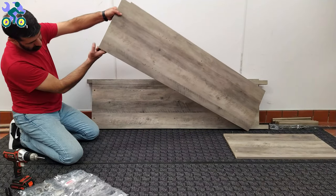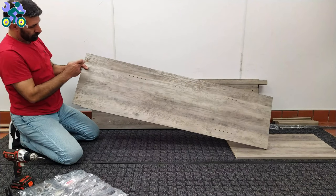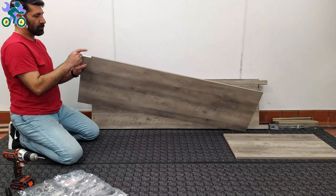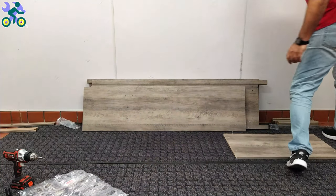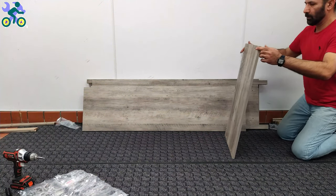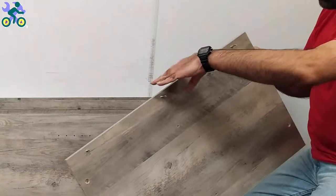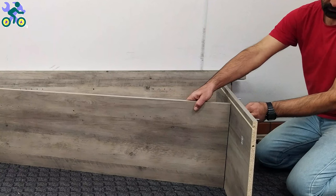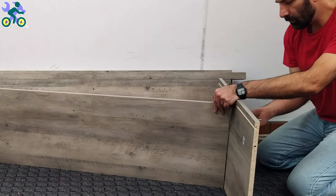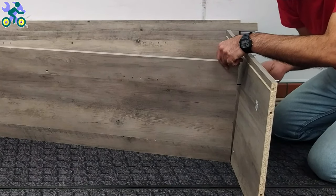Now connect part D2 to part C, making sure that the groove of part D is placed on the top side and toward part C. Also, the notch of part C is placed on the upper side and opposite to the direction of connection with part D2. Connect the parts with 2 screws or part 113S to each other and make sure that the screws are connected in the desired place on part C to prevent it from being damaged.